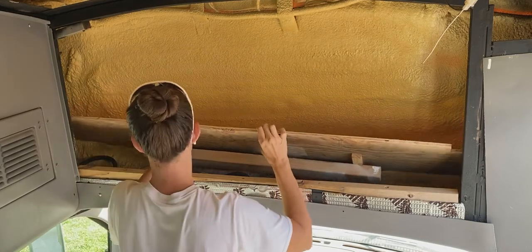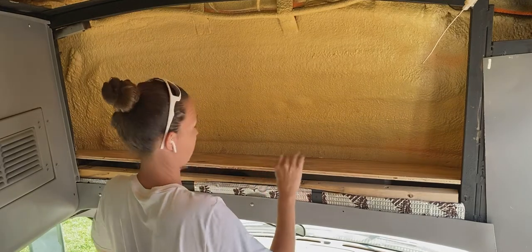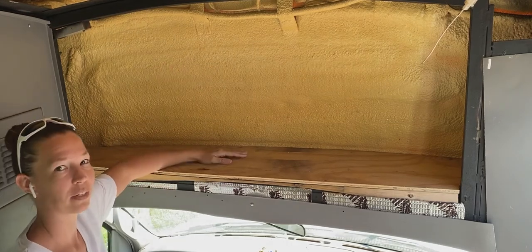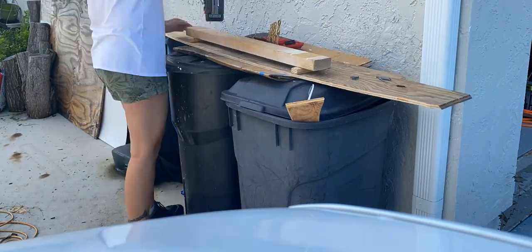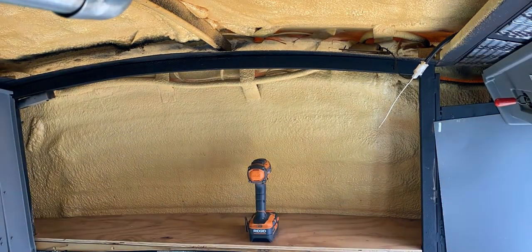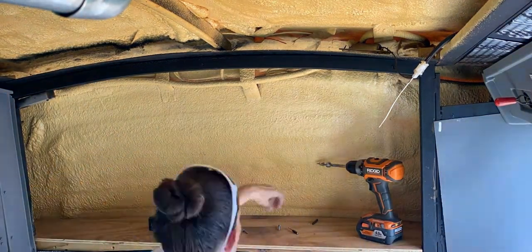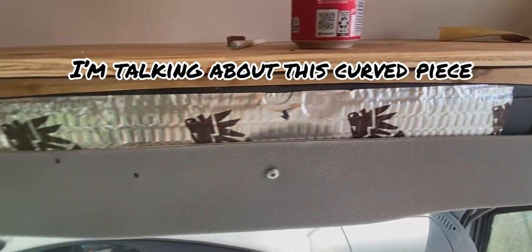The shelf is difficult to get in but it lays flat now. This is the base upon which I'm going to build my shelving unit. In order to make sure that everything was secure I pre-drilled some holes and put some different size screws in place to make sure that 2x4 would never fall off the bottom of the shelf. I then attached the shelf to the wooden beam with some pocket hole screws and cut it out with a jigsaw.